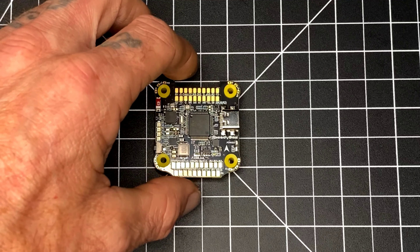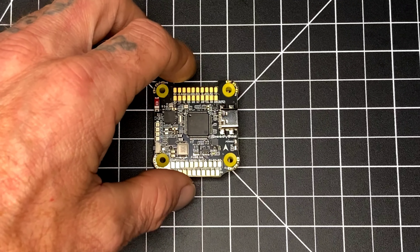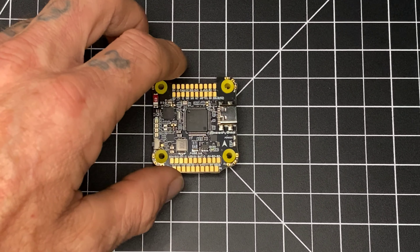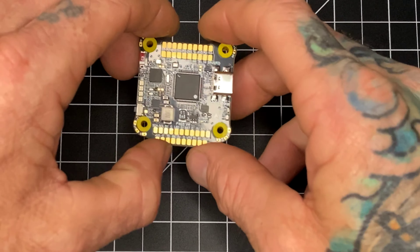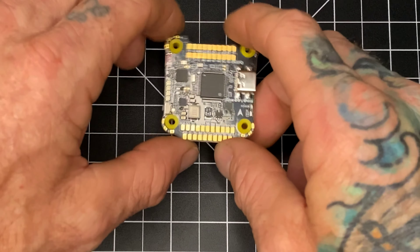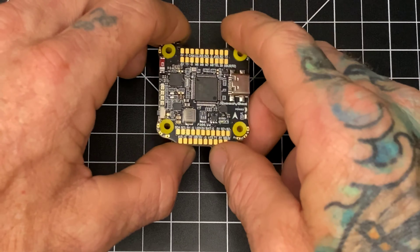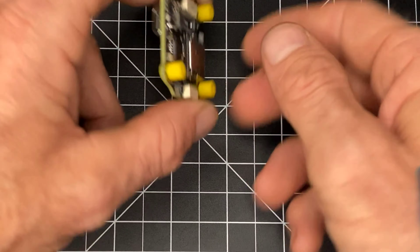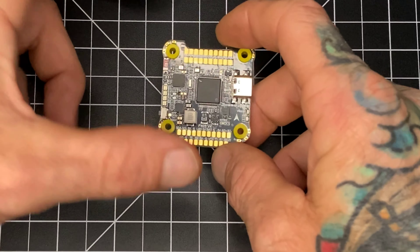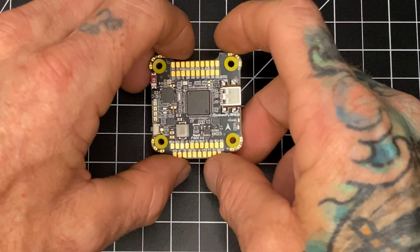The very first thing is located right here — the gyro on the board, which has been updated to an ICM 42688, which has proven to work better than the BMI 270. Filtration has seen some changes where now they're using Max Linear's filtration chip, which is going to give very clean, noise-free performance, translating into lesser filtration needed.